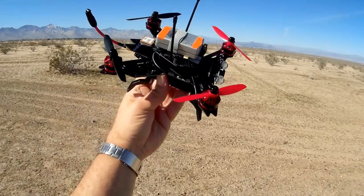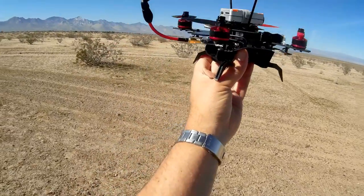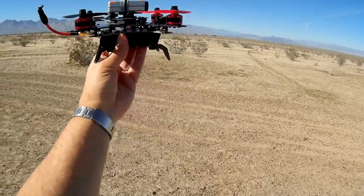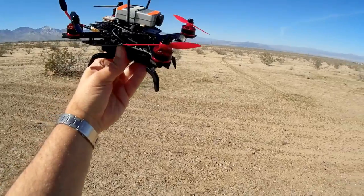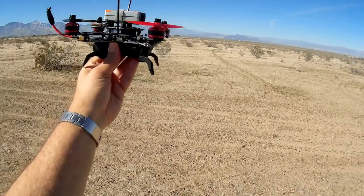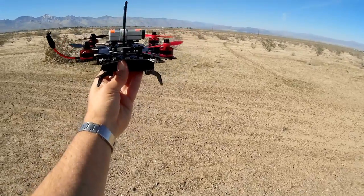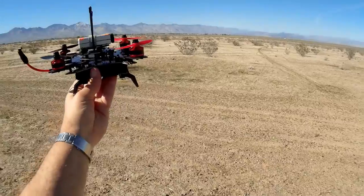This one in particular has GPS to assist it. It does have position hold, but I think it's more or less mainly to help maintain altitude. It also has a barometer inserted in there somewhere to help it maintain altitude. That, in addition with the GPS, helps it maintain altitude pretty well, particularly if you're accelerating or moving.